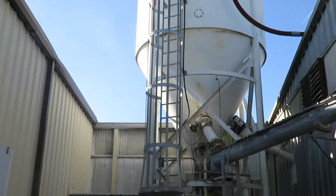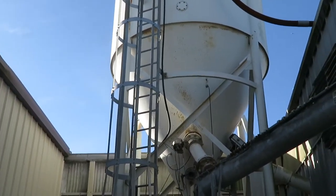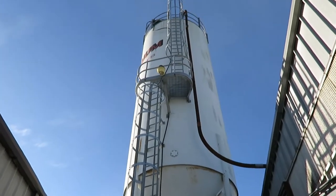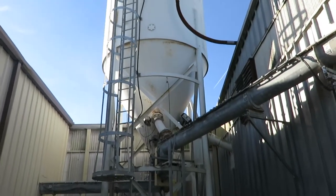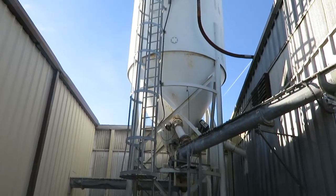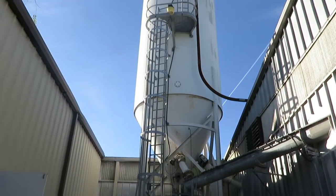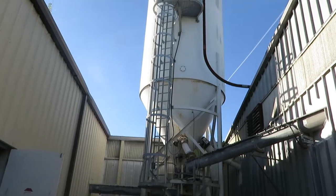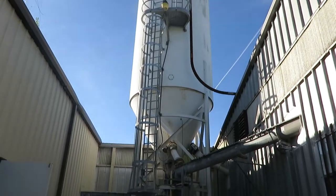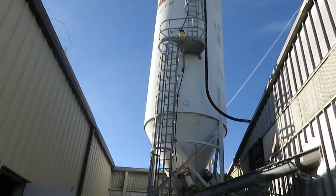You can see on here it's just pretty much surface rust. We'll put the high reach up on the very top and look at what's going on up there. Generally on these silos here in Florida, the corrosion's mostly on the top. When the roof is flat, you'll always have really bad corrosion because water just sits on top and can't drain off — the sun has to evaporate it. If it's pitched, you probably won't have much corrosion because it'll just run right off.